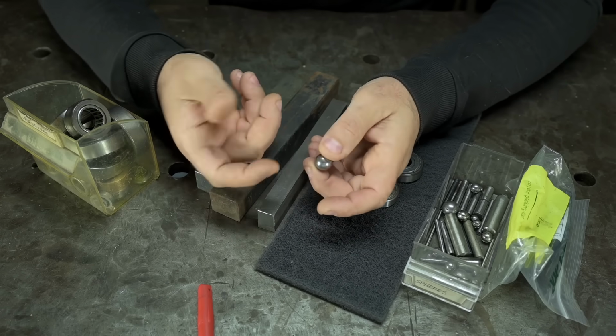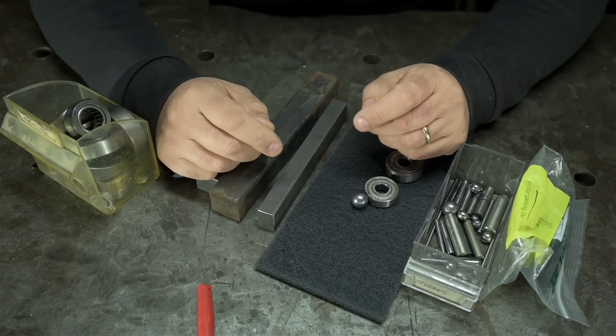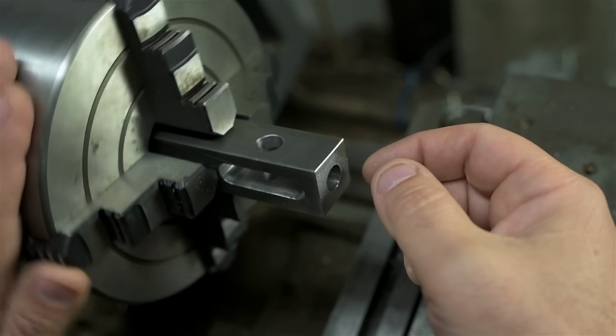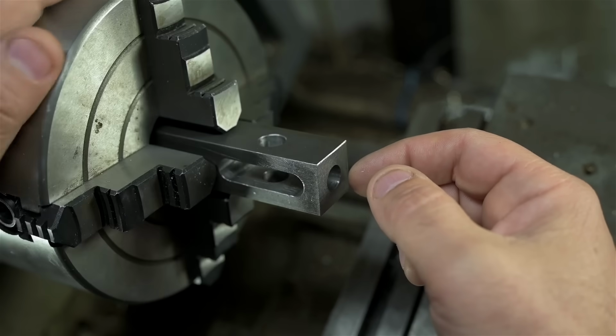Like to the part, how much will the diameter change? I suppose that depends on how rough the last cut is, how big the ridges are I'm leaving behind and smushing down, and how much pressure I'm applying. I guess we'll see. Well, now comes the one and only hard part about this build.